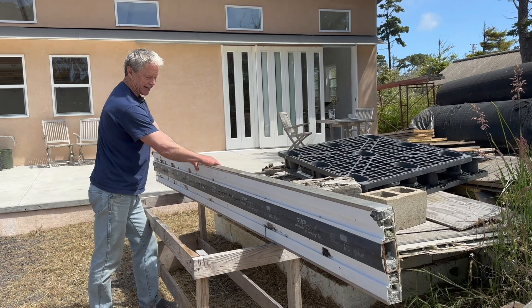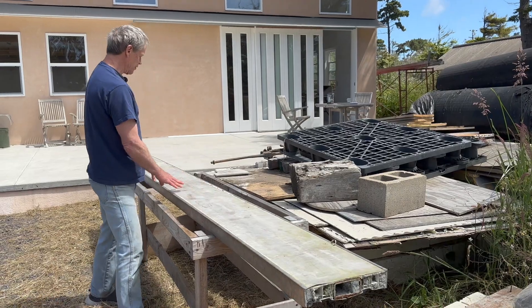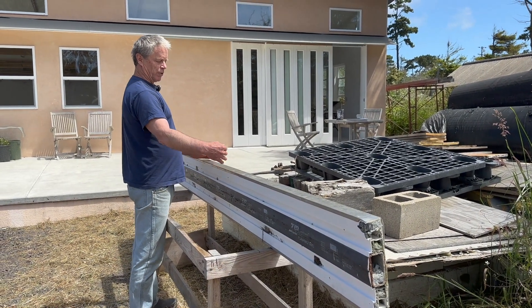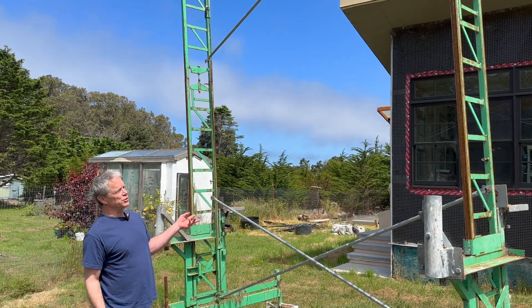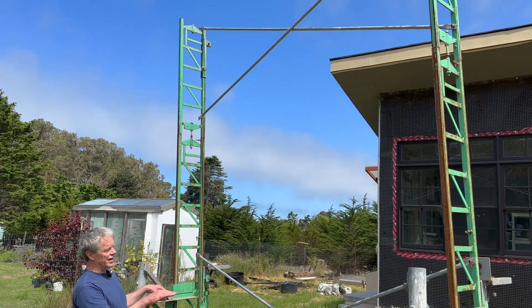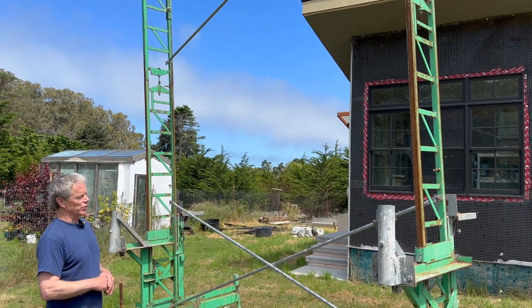We place concrete behind it. It has a special surface that lubricates, so water comes through this material, and it's on a controlled axis which lifts it up — as it goes up it creates a concrete wall. This is one of the versions we use to drive that screed: a lifting scaffold with a couple of motors to lift the screed and place the concrete.